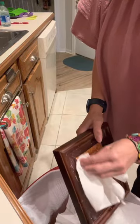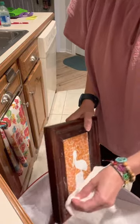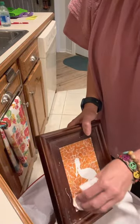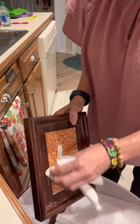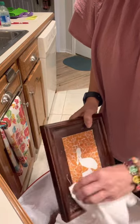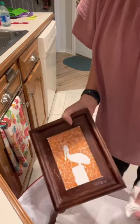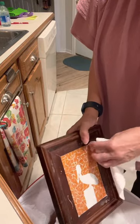This is just to get that excess off the top so it doesn't sit and get hard. Once we get all this off, we're gonna let this sit for at least a few hours because you want to make sure the grout has dried all the way before you put the sealer on. If you want to let it sit overnight, that's even better.